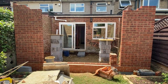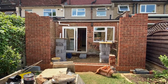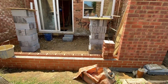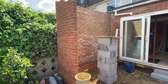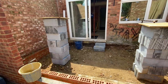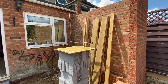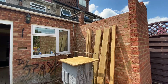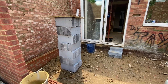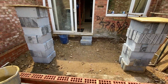Jumping forward, the external walls have all been put to their final height. You can see a slight lowering of the sections on the inside where the bifold doors will be — that's where the lintel is going to sit on top. We're going to put that lintel in before finishing everything. Here are some blocks — we'll be doing the internal walls in blocks, which is cheaper, and they'll be plastered out so you don't need expensive bricks on the inside. The internal walls will be plastered over and painted, so you won't know what they're constructed from. Blockwork is cheaper to buy and lay, so it makes absolute sense for internal walls — absolutely standard construction for any project.